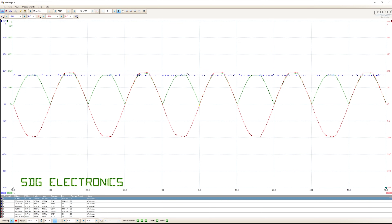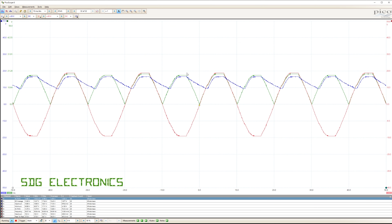Once we add about half an amp of load, you can see quite a bit of ripple because the capacitor is now supplying charge between the peaks. Once the rectified waveform exceeds the voltage on the capacitor, it charges the capacitor. Between the red and blue waveforms there's a voltage drop, and once the AC waveform drops below the capacitor voltage, the capacitor supplies charge until the next rising AC voltage.